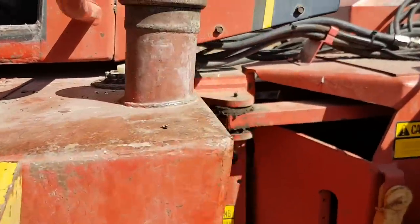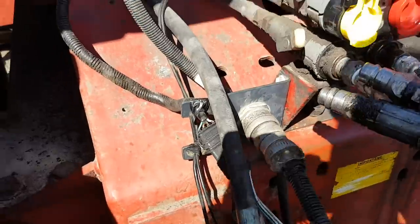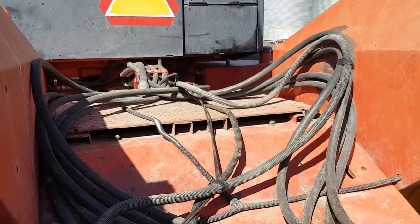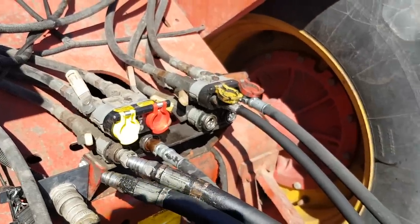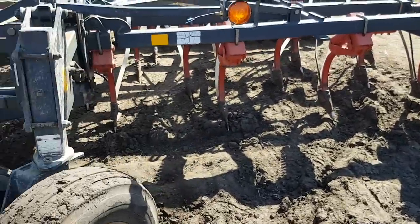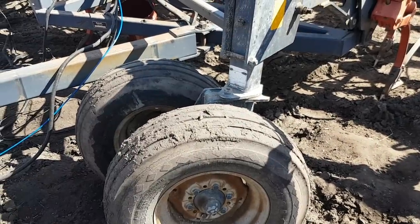The other thing I've got to do — I don't know if any of you guys have ever heard of a proportionator valve, but I need one to run my fan. It's got a case drain, and there's a return hose, a pressure line, and that valve — that's how you run the fan on your cart. I tried just hooking it up to the normal remotes and turned it on with number four, which gets priority, but with the fan running I couldn't lift the cultivator. I've got one of those valves on the 835, so worst case I just take it off of there and they'll have to share. Got our nice new beacon lights on here — this cultivator never had one — and then our double casters as I was talking about in that other video.